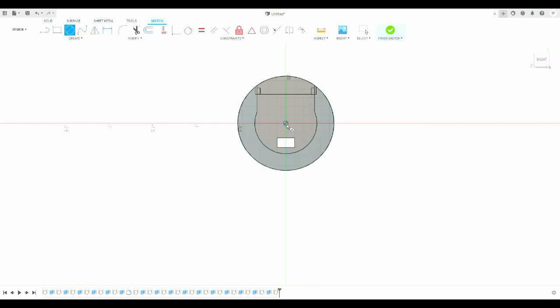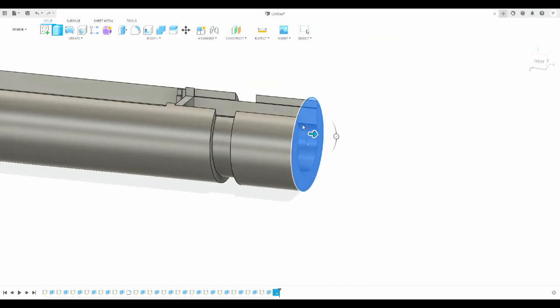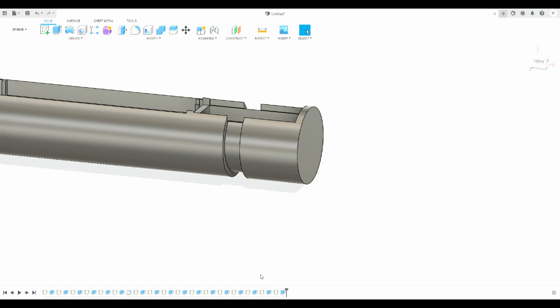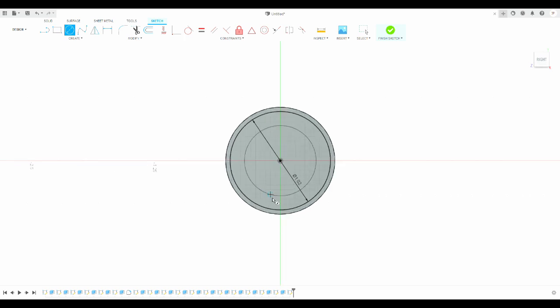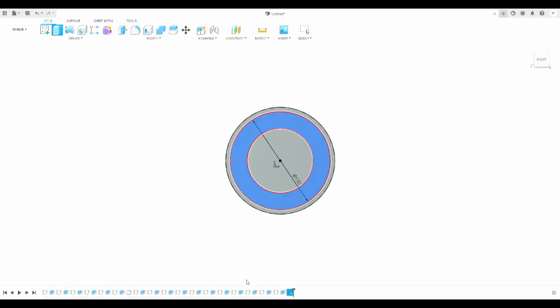I'm going to draw another circle and close this off by 0.1 inches, just like that. Now I need to measure the part that's going to go inside the saber — inside the top half where this chassis gets buttoned down into the saber, and that's what holds the chassis to the saber. That upper part for me on the Democracy hilt is 1.02 inches. I'm going to draw a circle here at 1.02 — that's what's going in there. I want this pretty thick so there's plenty of space for the chassis to grab into the upper part, and then I'm going to extrude this.